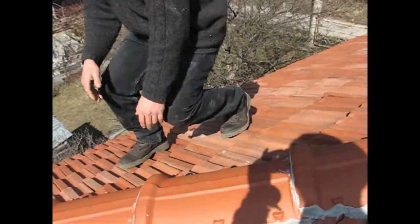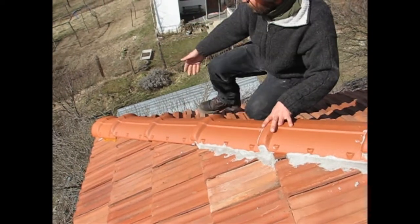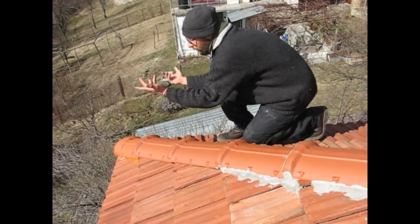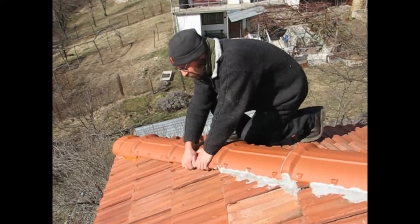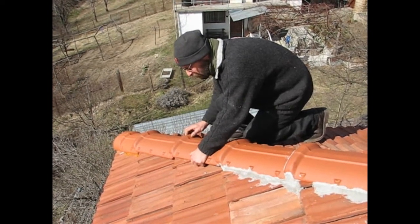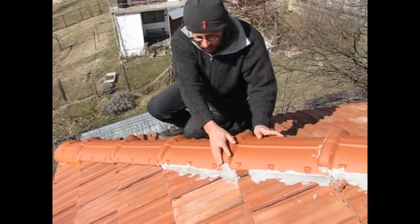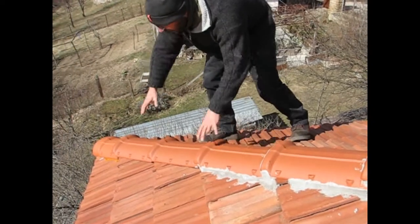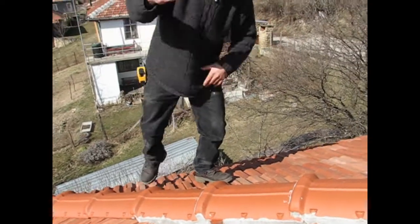This looks nice. The bottom three tiles we didn't do yet because we still have to put gutters onto this roof this year, and you have to lift up these tiles to do that. So these are not done yet. But this is something you don't want to see on a finished roof, because loose tiles can fly away in the wind — they move, this is not good. You want to have mortar, you want things fixed in place, everything done properly. Once we put on the gutters, we'll take off these tiles and cement them back on.